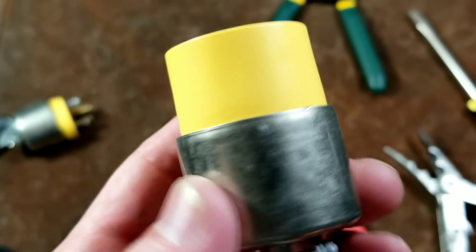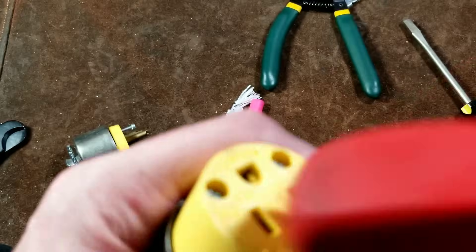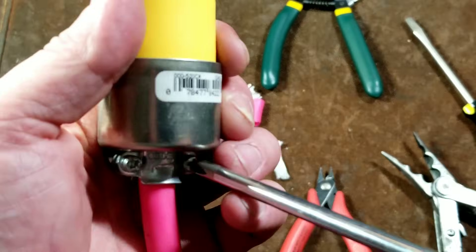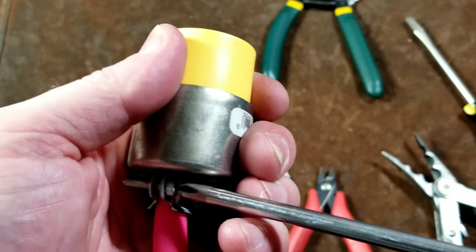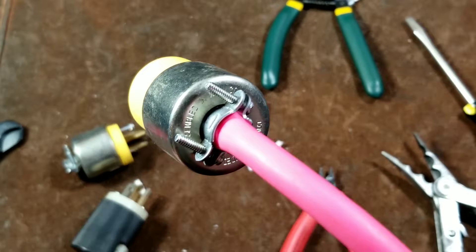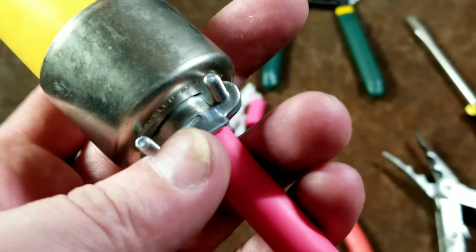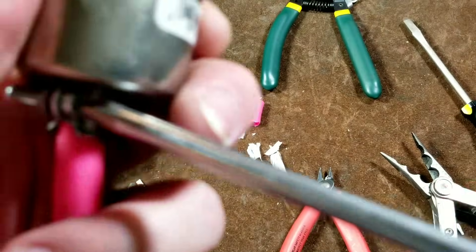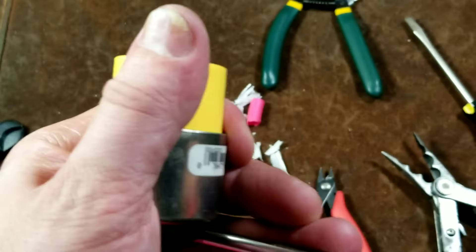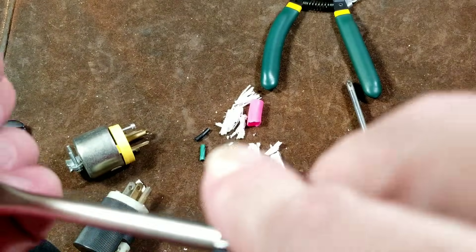Another thing to mention on these Levitons is this little cup kind of sits in a recess and it doesn't always want to get in there level. So sometimes when you're pushing this down, you actually have to tap on the end of it to get it to really seat in the shell — something to be aware of whenever using these armored cord ends. Also, if you were choosing to put this style on a smaller 16-gauge extension cord, you need some layers of shrink wrap in order to get the wire to be large enough to really work in the cord pinch or strain relief. And it looks like we're actually getting pretty good here — I like to make sure they're balanced, so maybe a little bit more on this side.